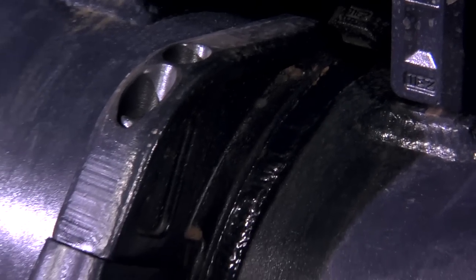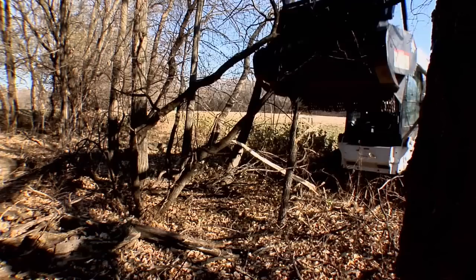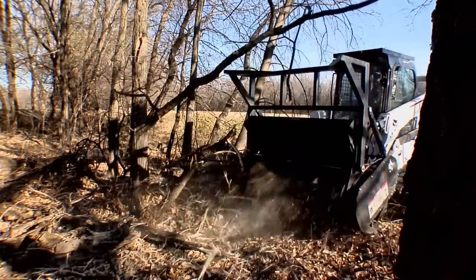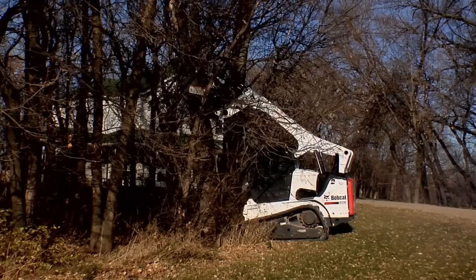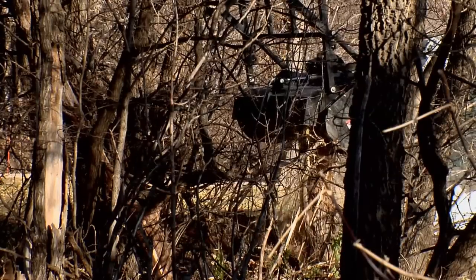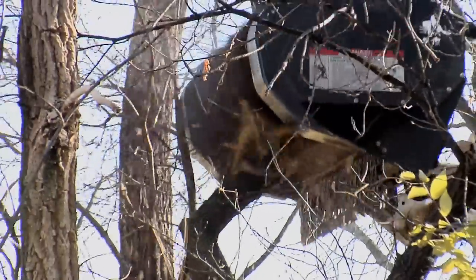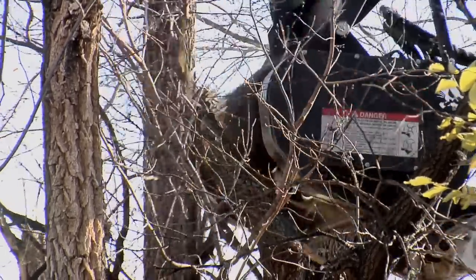A larger drum gives you more surface area to attach the cutting tool, which means a stronger bond to the drum and ultimately more inertia to tear apart material without stalling. Bobcat Forestry Cutters have fewer teeth than most, but the teeth are larger, ripping off bigger chunks of debris and then feeding them into the unique counter cutting combs. The spiral pattern design places the teeth further apart, hitting material at different intervals for more consistent performance, smoother, faster cutting with less hydraulic horsepower.